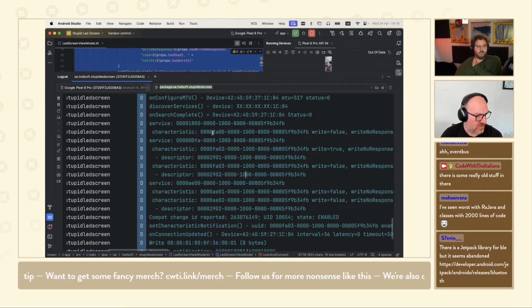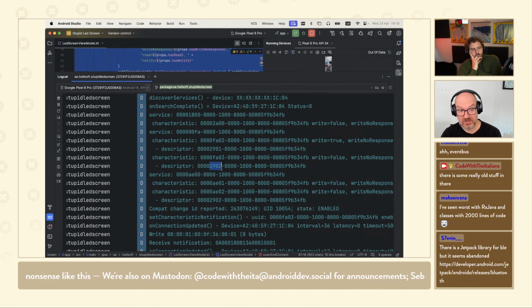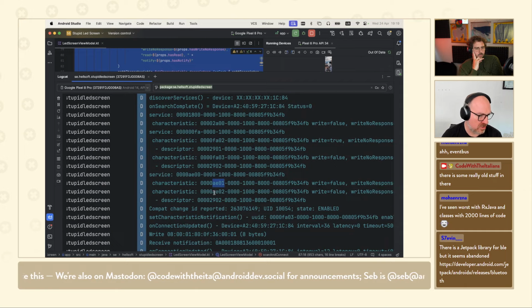So there are some magic numbers in the first chunk of the UUID. The upper part here is always zero, it seems. And then the one with 29 — this device or in general? In general. So it's only the last two bytes of the first group that are meaningful. The 29 stuff is reserved in the Bluetooth spec. Then you can have pretty much anything you want here.